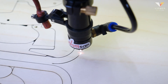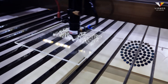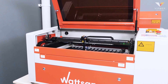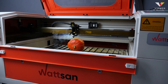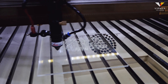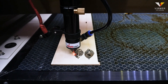During operation, if the machine moves the laser head slowly and sets a high power of radiation, we get such an intensive impact on the material that the laser cuts through it. Engraving, on the other hand, requires high travel speed and low power. The machine moves quickly left and right, shifting step by step by about 1 mm, as if it were performing a burn-off. The laser head travels at speeds of up to 400 mm per second, and the control system has enough time to switch the laser on and off in just the right fraction of a second to produce a high-quality image. The laser is used to engrave and cut highly precise shapes and images, thanks to its high resolution and a positioning accuracy of 0.01 mm.